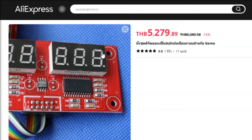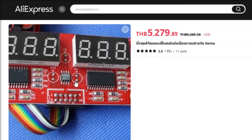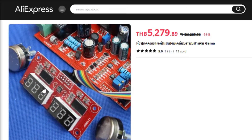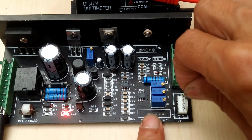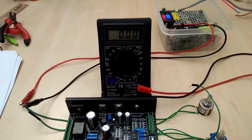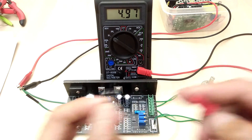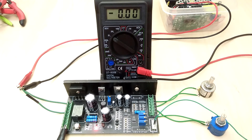The photo in this AliExpress listing is very clear and I can almost reverse engineer it. Surprisingly, the small surface mount IC on the board has its part number erased, but I am pretty sure it is a non-inverting op-amp. I connect a jumper wire to pin number 6 of the terminal and we should also see 5V there. I intentionally connect the jumper wire to the 5V output because next I want to check the relay driver circuit using this voltage.